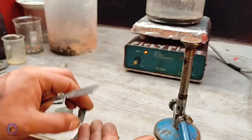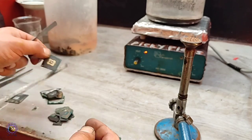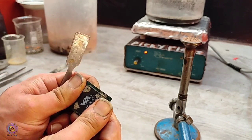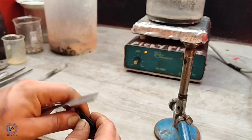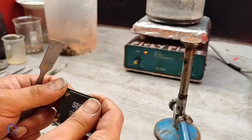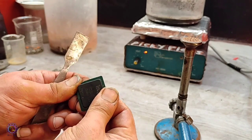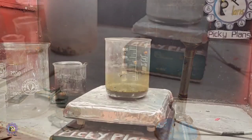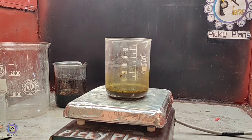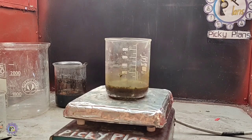At the same time, I'm detaching BGA chips from the motherboards to make them ready to be processed. There is still some impurity alongside the gold foils — some plastic particles from the motherboard slots in the solution that were oxidized with nitric acid and separated like a sponge. Finally, I added some hydrochloric acid to the gold foils, which are quite impure, and then started adding some nitric acid to make aqua regia and dissolve the gold foils.